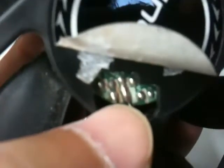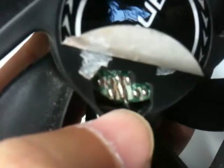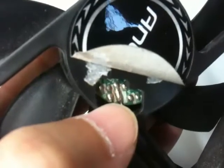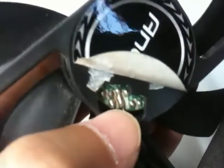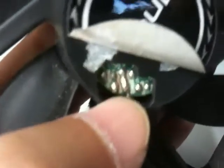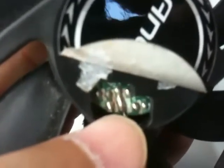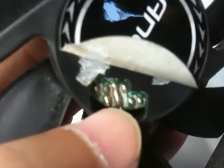I can't seem to focus with this camera, so I can't really show you where the wires break off, but if yours broke off the same way you'll know where it came from. You will need a soldering iron. Looking at this one, I don't think I would need additional solder wire because there's enough solder here to reconnect the wires. I think you just need to slightly touch the top of the solder so it melts and you stick the wire back on. I'm going to do that right now with the soldering iron.